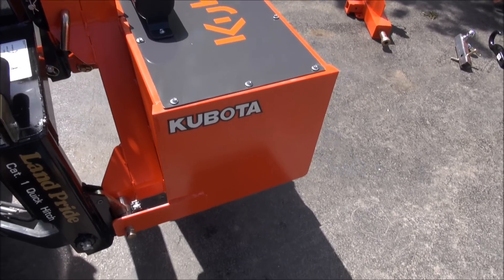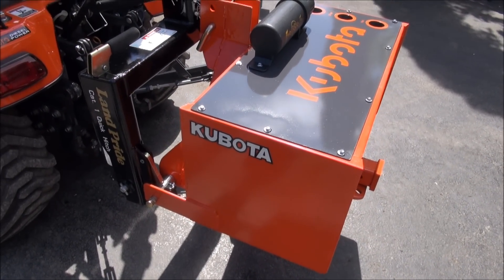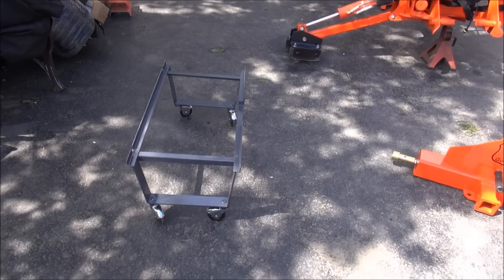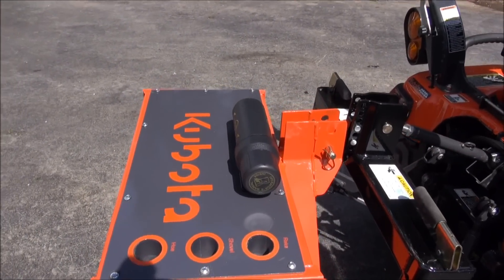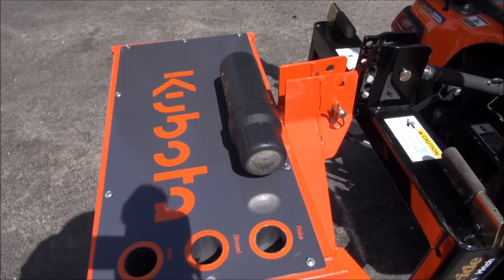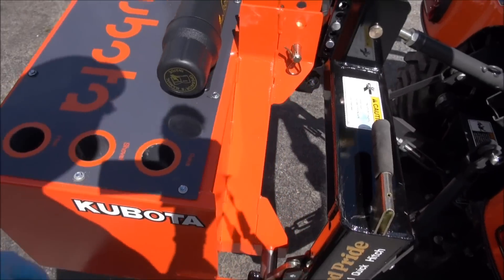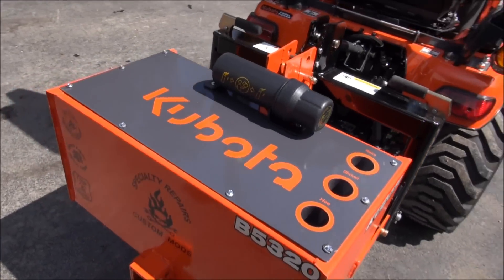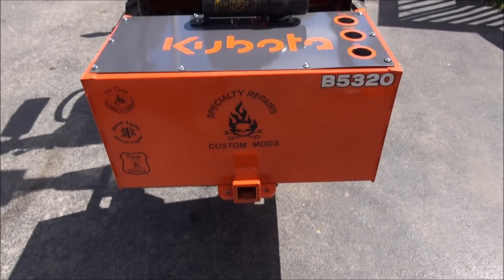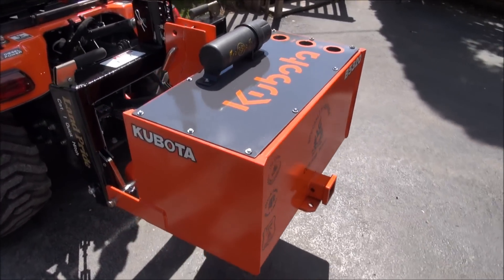It works really well. The only problem with these ballast boxes is they don't go low enough — the three-point hitch is still about a foot off the ground when completely lowered. So I made a quick stand on casters so I could push it around. I also put one of these literature holders on the ballast box — you can put gloves, a first aid kit, a rake, a shovel, whatever in there. I put a cover on it too. It's filled up with sand and the approximate weight is around 350 pounds. I also integrated a hitch receiver into it, just in case I need to pull a trailer around the yard.